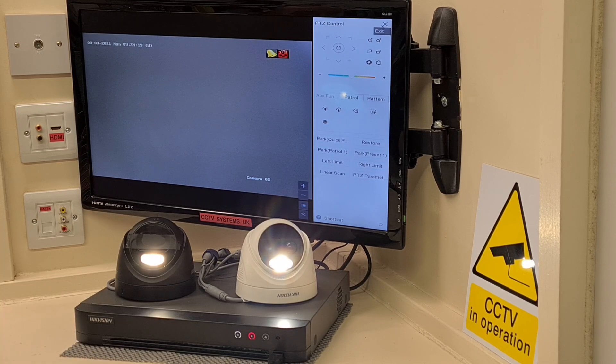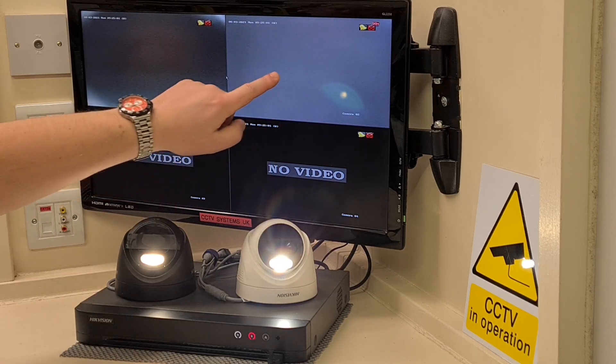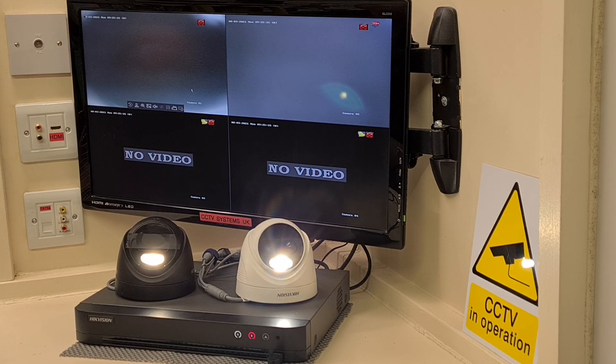So that's how easy it is to adjust the lights on these cameras. You can switch the light on or off, change the threshold - which is the sensitivity of the chip controlling when the light comes on and goes off - and adjust the actual light level from number one (lowest) to number five (highest). I've illustrated that today. It's great to put a piece of masking tape on the front to trick them when demonstrating, because these cameras love light. Even with black masking tape on, they can still see the ambient light. I'll post this video link to all those YouTube questions we missed, and hopefully it helps those who couldn't figure out how to adjust the lights.